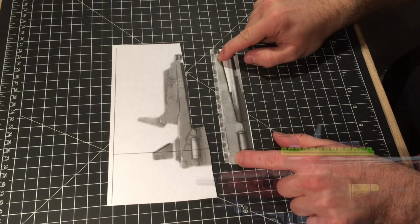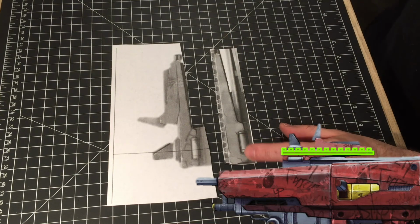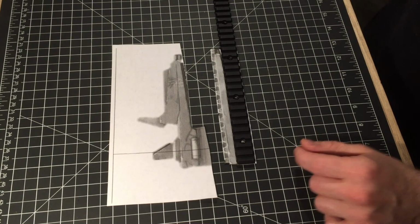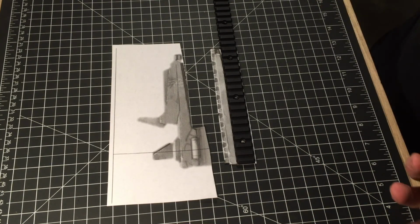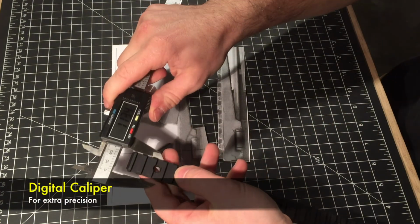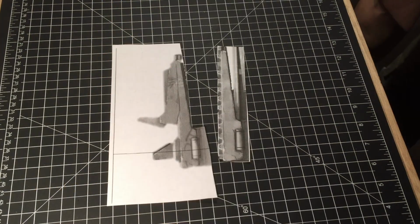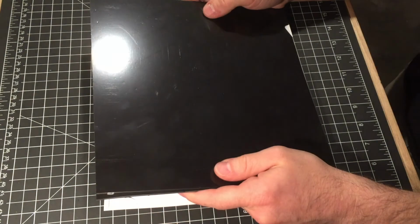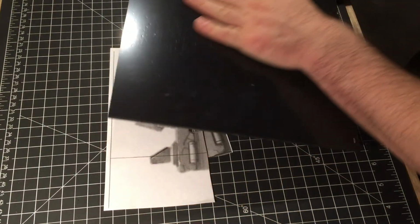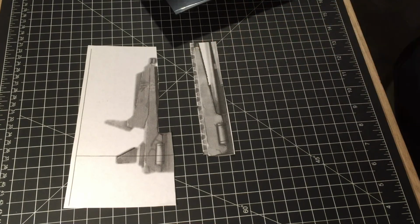The top of the sight mount has this rail on it that looks like a mil standard 1913 rail. So I wanted to use a section of this mil standard 1913 rail that I have. Unfortunately, it needs to be 1 inch wide. And 1913 rails are not 1 inch wide. So I'm going to have to make a rail. I'll use more of this ABS plastic sheet because it's pretty nice to work with, and I don't want this little unsupported end to droop.